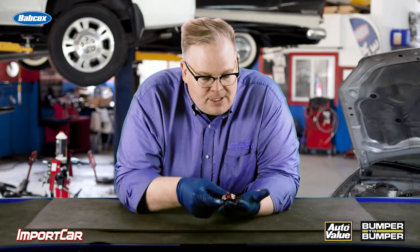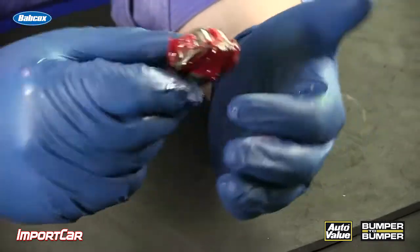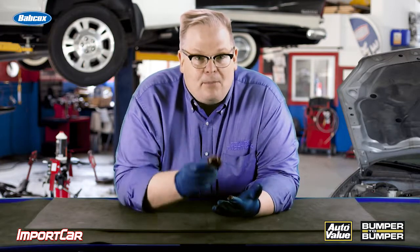So when you're packing one of these bearings, just make sure that you have enough grease inside the races themselves, and maybe even on the stub axle. Do not pack grease into the hub or flange itself.